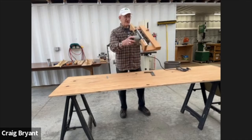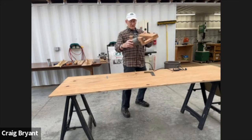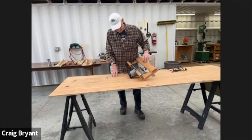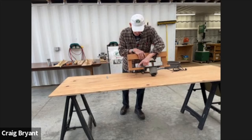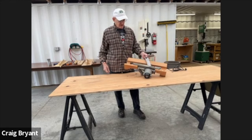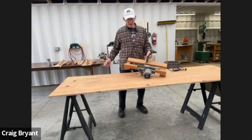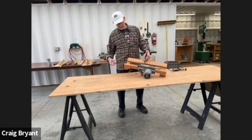If you look at this, you can see that the fence is not quite perpendicular, but that by itself isn't going to work. You can't really put that up against a half-inch piece of plywood and have it hold. So you really need something auxiliary. That's why I whipped up this hardwood frame that bolts to the fence. I drilled a few holes and screwed this thing in. One of the disadvantages is it's a narrow power planer, only 2 1/4 inch. It wasn't that helpful for half-inch plywood, but it gets you started. Being kind of lazy, I thought I'll let this do the first part, and then I'll use the hand plane to do the rest. It definitely gives you a reference, gets you more than halfway there.